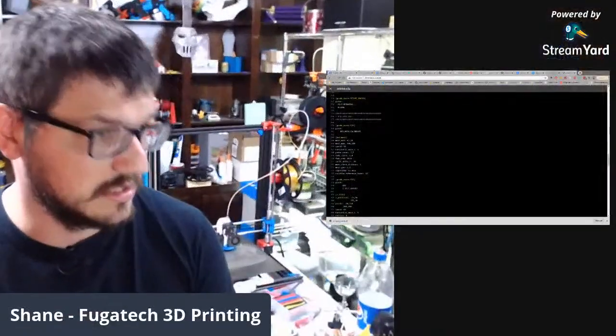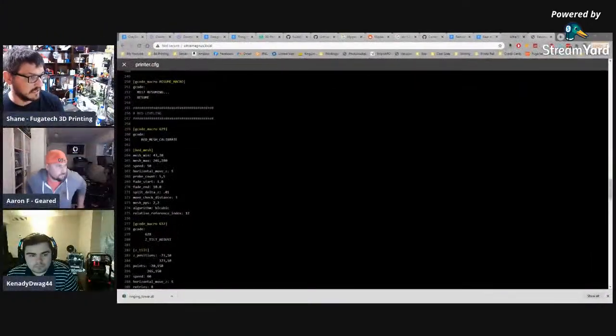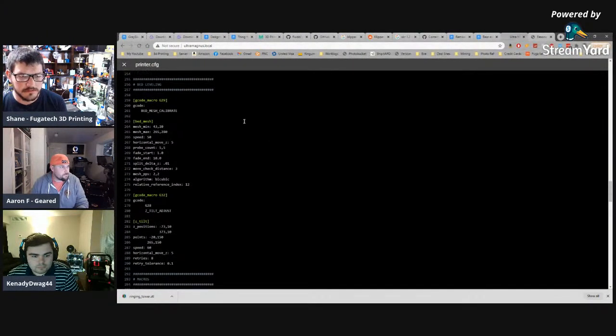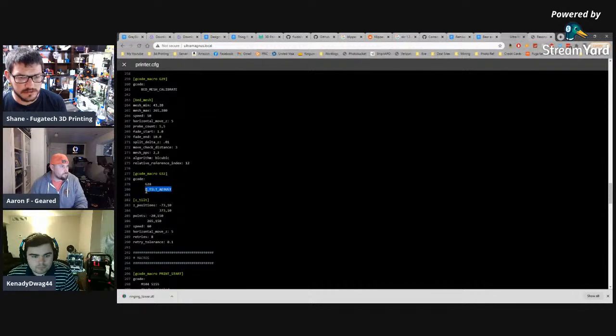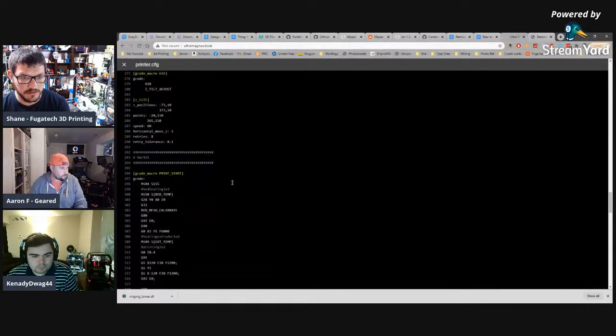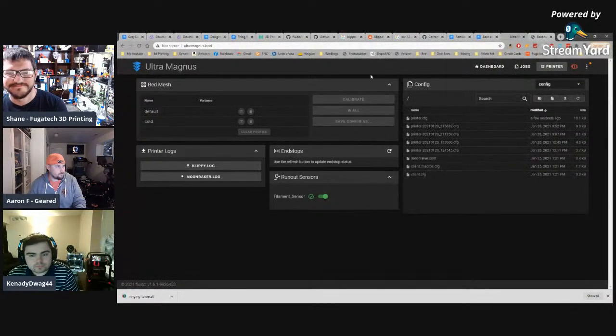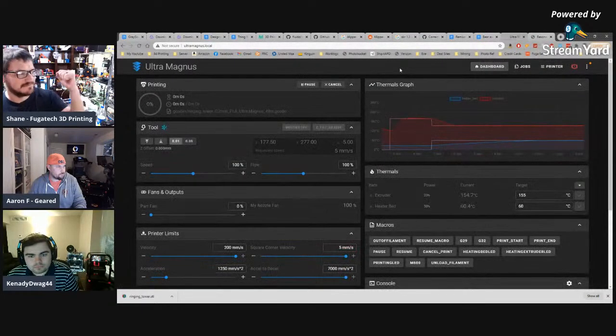Oh, that's interesting. Let me look that up. I'm going to pull this up so if anybody wants to see what this is. Whoops, that's not the right one. That's what I want right there. So there's the mesh Z tilt adjust. Copy that and then put it in print start, right there. Like that, right? So now it will only home once. All right, I like that. Efficiency.